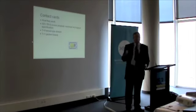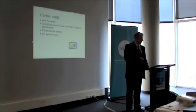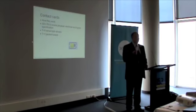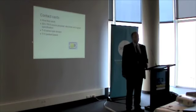So if we're going to have lots and lots of these around the world, what we want to start doing is getting some standards out. So we can have common manufacturers, we can have common interfaces to these things. And that's what ISO 7816 is all about. That tells you, right, I've got one of these things, what can I actually do with it? You look at ISO 7816, that will tell you all the things. It will tell you the size of the card, where the contacts are, what the voltages are, what the protocols are to talk to the thing.